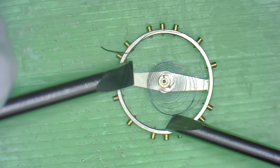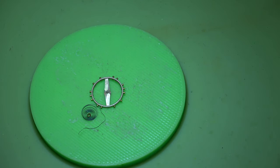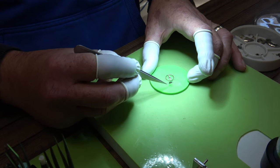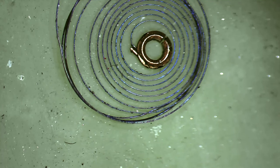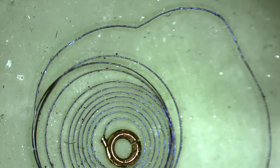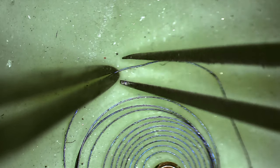Before I clean this I'm going to have a little look at this hairspring. First thing we're going to do is remove it from the balance wheel - use a couple of screwdrivers to do that, do it carefully. I don't think I could do much more damage. Once it's removed from the balance we can have a closer look. It's out of round, out of straight. The idea really is to find where the first bend is and address that, or we can start on the outside, which I think is where I'll start as that seems a little easier first of all. So we'll take out that bit of a kink.